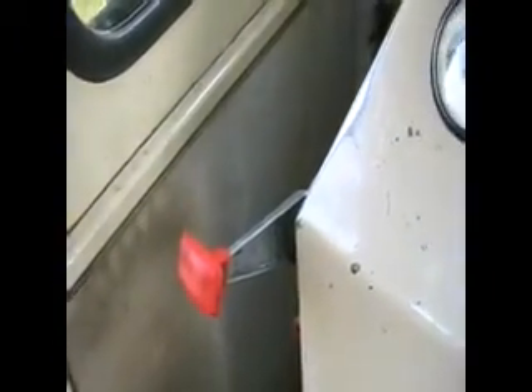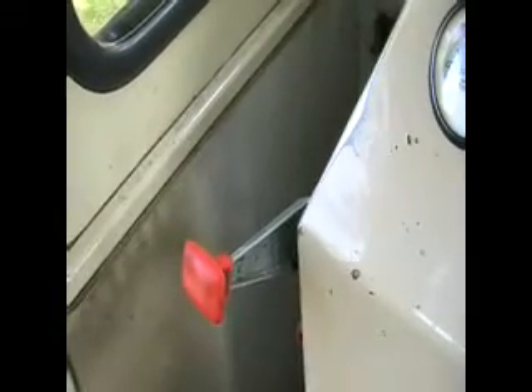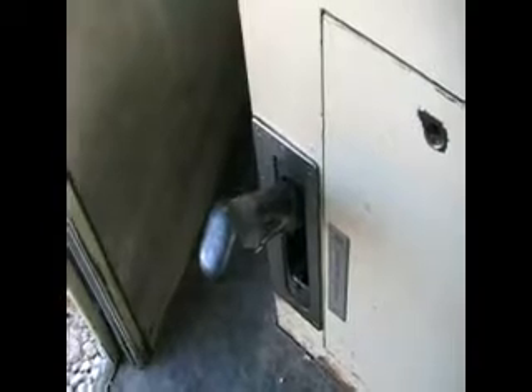Down here, the power handle — push forward to apply power, pull back, that's in shut-off mode. We're on tick-over mode. Down here towards the bottom of the floor, handbrake. It could be mounted anywhere else. That's not hydraulic — it's a caliper onto a disc, but it's actually connected via a wire rather than any sort of hydraulics.